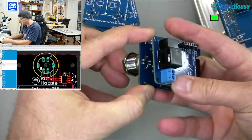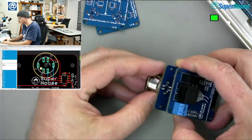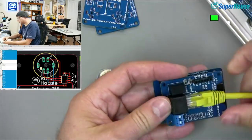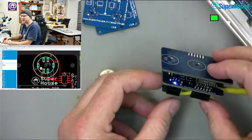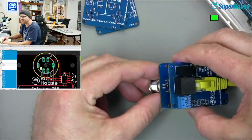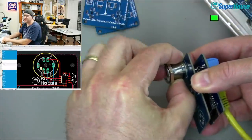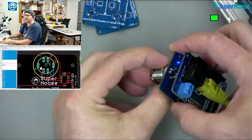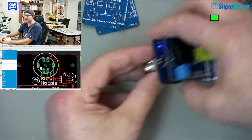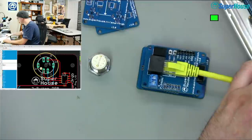So it goes that way, and then that goes on there. Let's power it up and see what happens. We've got power on the controller — that goes in that way. We don't have anything coming up on the RGB LED, which is kind of what I expected, because I haven't yet configured TASMOTA to tell it what IO pin to use, the fact that it's got a WS2812 connected to it, and all that sort of thing. So I need to go through the process of doing that configuration. I'm going to do that when I'm not on the live stream — although maybe I should live stream those sorts of things as well, because that might be interesting for some people.